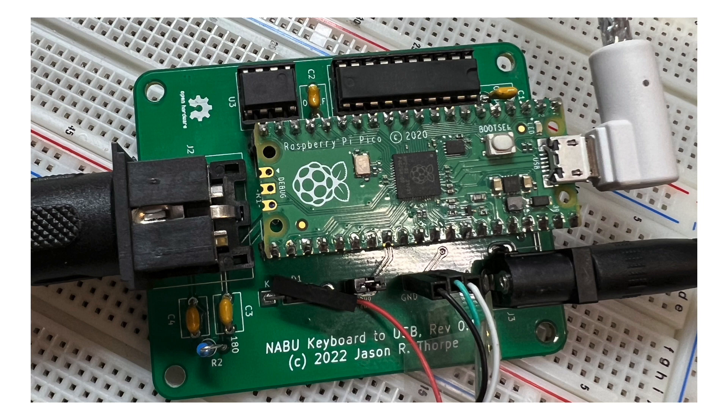After I had it all working, I laid it out on a PCB in KiCAD, and then I sent the Gerbers off to PCBWay for fabrication. This is the first version of the board, and it actually had a silly mistake in the RS-422 circuit, which on this board I fixed with just a couple of cut traces and bodge wires. I've since fixed the design files and had a new batch of PCBs made, and I built one of those up the other day and it worked perfectly.